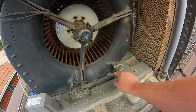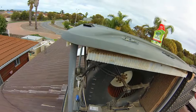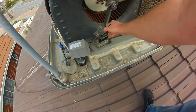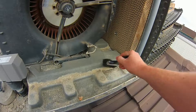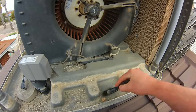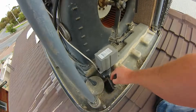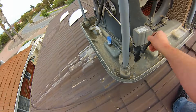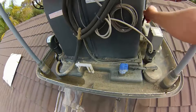There's a little flap valve that opens to let air through into your home and closes when the fan's not running to keep vermin out. I start my service by grabbing my paintbrush and wiping down dust and debris accumulated at the bottom of the cooler. I'll make a few little piles and then vacuum it up. I do not recommend pushing debris down the dump valve — it can block the pipe and you'll be calling a plumber.